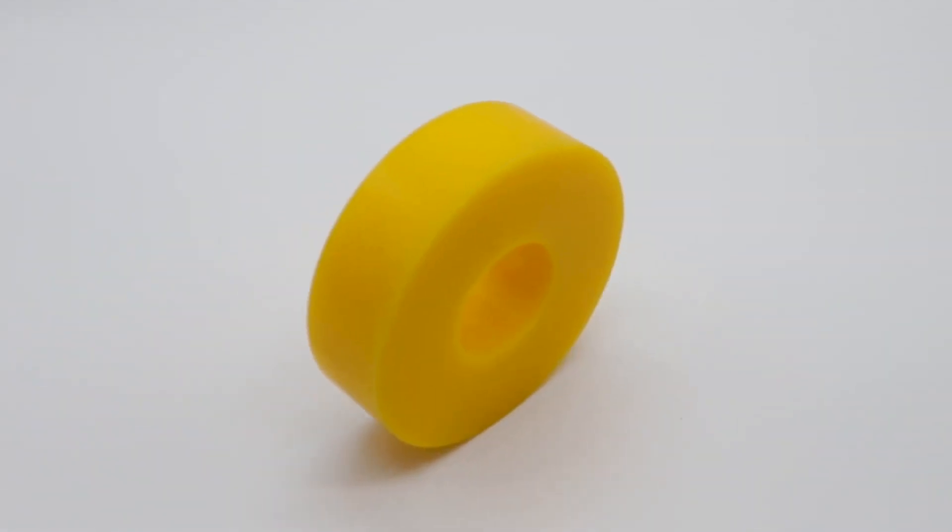You're going to need to know how many pounds of force, whether there is room to bulge, and what the footprint of the part is. You always want the urethane to be three times thicker than the part you're forming.